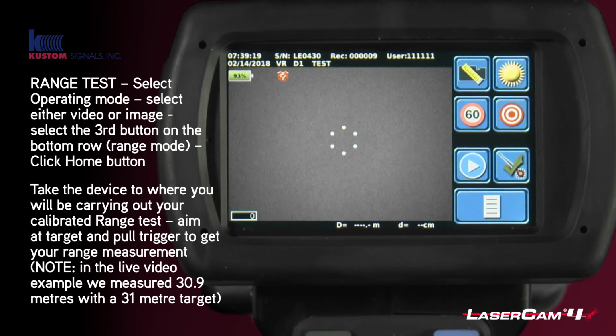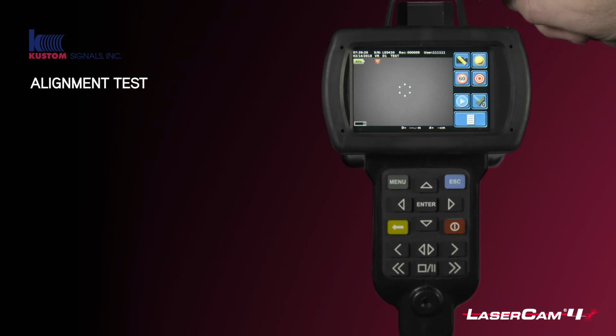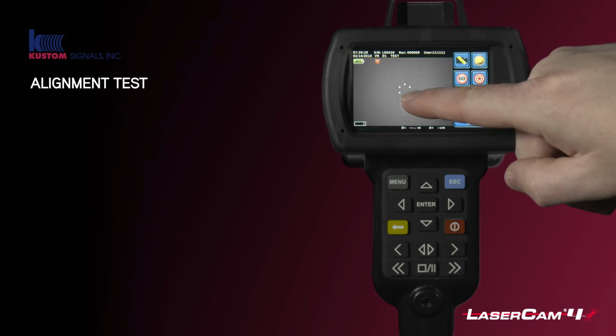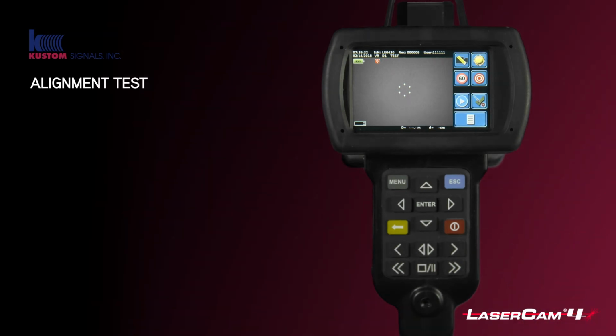The second test that you need to do is what we call an alignment test. This is to check that the head-up display, the reticle on the screen, and the camera on the front and laser are all in alignment with each other, meaning when you target a vehicle, that particular target has got the laser on it and the head-up display, and the camera is also looking at the same vehicle.